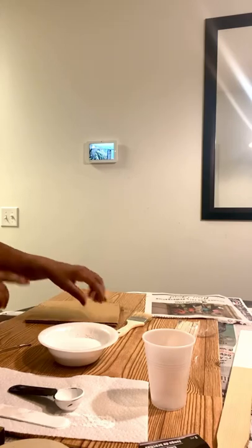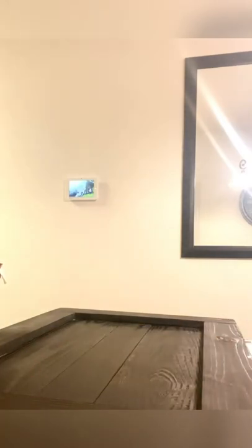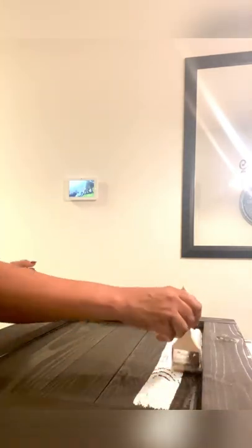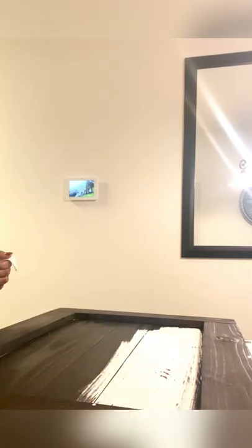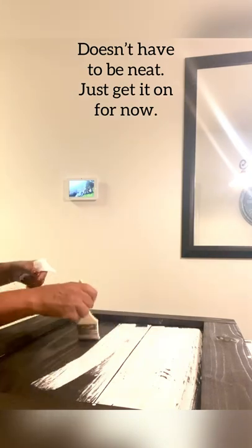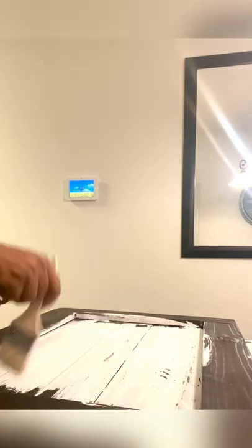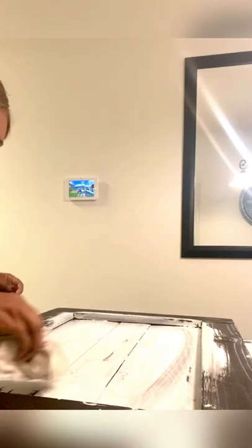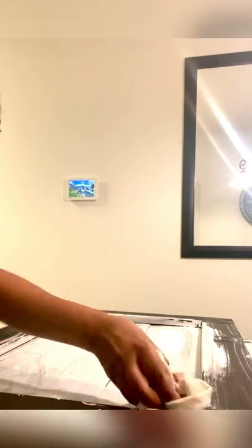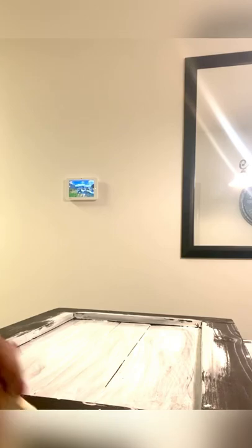We'll go on to the next step of adding this white paint mixture to the board. I'll start painting down the center first to get that covered, and then of course I'll go over the sides as well. After you've gotten it on, after just a few seconds, take a rag and rub it in all over. Don't rub very hard — you just want to mix it all together, make sure you haven't missed any spots. Continue to spread it in the other areas.